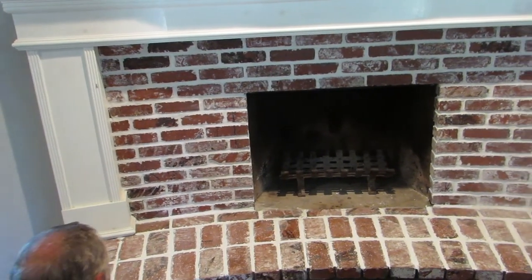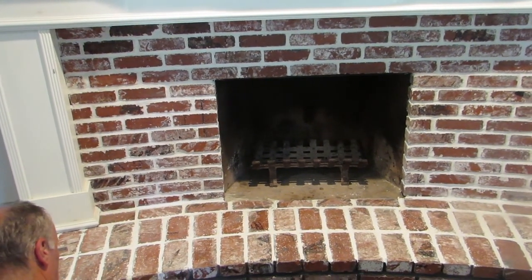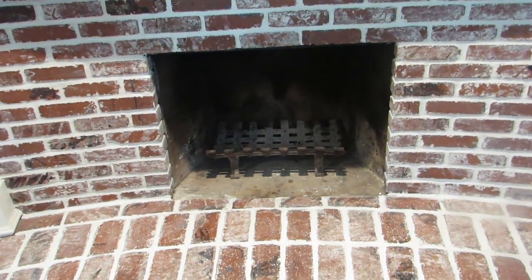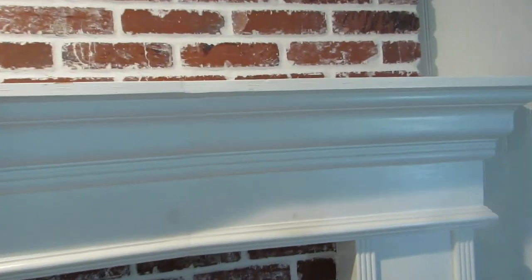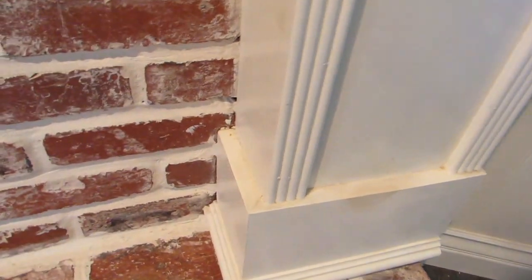And then I think he's going to touch up the glass doors and the screen? Oh yeah, I gotta readjust those too. Yeah, and then we'll put those back on. We're gonna go ahead and lightly sand this mantle and repaint it. Let me see if I can pick this up right here where it bled through. We're gonna go ahead and put shellac on there and repaint so those shouldn't come back through, because we did this before we learned about that little trick, so you can see them. I think there's some over here, so that ought to take care of that.